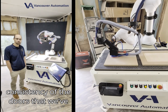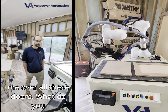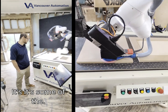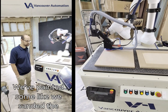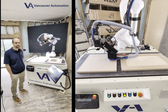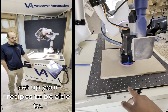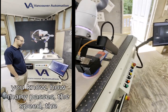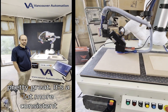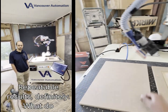What do you think about the quality and consistency of the doors that we've sanded, and then you sanded after me over all these doors? Yeah, quality's great. We've painted some that we sanded the other day and the quality of the paint's been better than what we've had by hand. Just the fact of being able to set up your recipes — how many passes, the speed, the pressure — it's pretty great. It's a lot more consistent than by hand, so it's repeatable results.